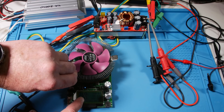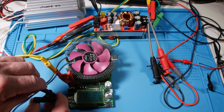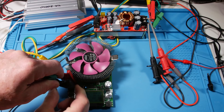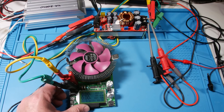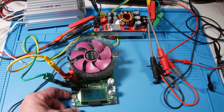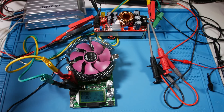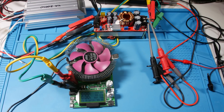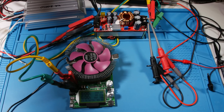The output is this yellow and green wire that wraps around here. I was connected to this 8-ohm resistor — let's disconnect those. I've got this thing powered up. There's a little blue LED down here. I've got the power supply turned on. I'm just going to crank up the power supply so this little guy turns on — this will put out about 19 volts. I'm going to bring up my lab supply to 12 volts.